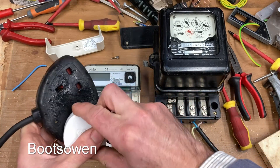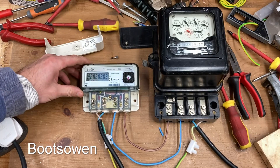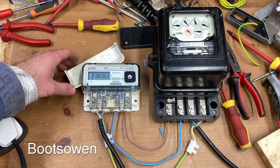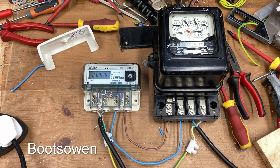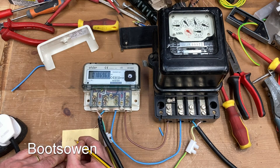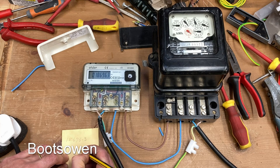Let's plug this one in and see if it wakes up. This one came with the solar panel system. It reads 18696.3 — so it has a decimal. This is an Elster A100C. I don't believe it was ever supplied by an electricity company; I think it came with a solar company, and the sticker is missing. So 18696.3 is presumably how much the solar panels have generated, though it may be how much has been fed into the grid after the house has taken what it needs. Over here on the analog it reads 7696.6, between six and seven.